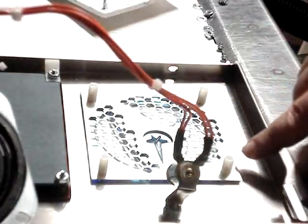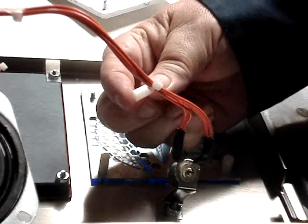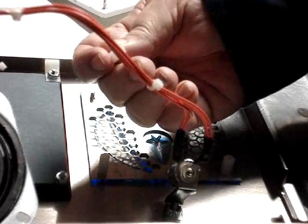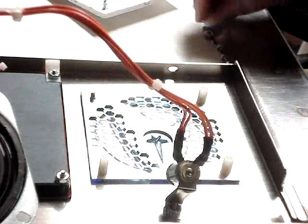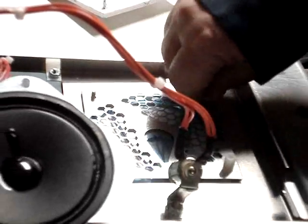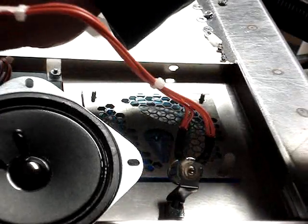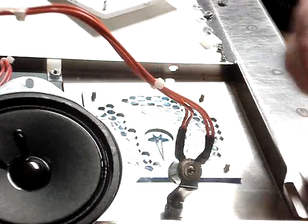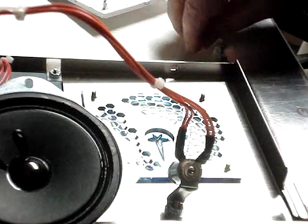Alright, now we'll take the speaker off here, and as you can see, what I've done is I've added these little 1/2-inch spacers, which are 1/2 inch long, and they are threaded all the way through with 6-32 threads, which is the thread size of the studs that's on the panel here. So you'll need 4 of those, and by the way, if my measurements are correct, these are the same size spacers that I'm going to need for putting the color DMD in when I get around to doing that. But I thought I would go ahead and do the LED lights in the speakers first, and then I'd get back to the speaker panel.